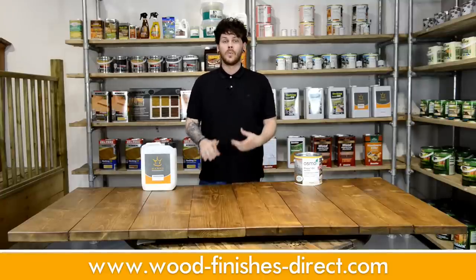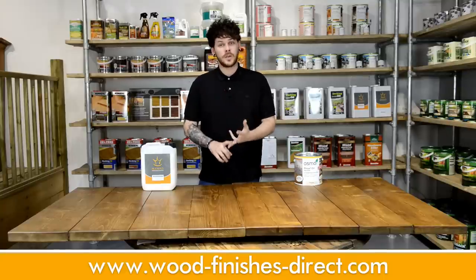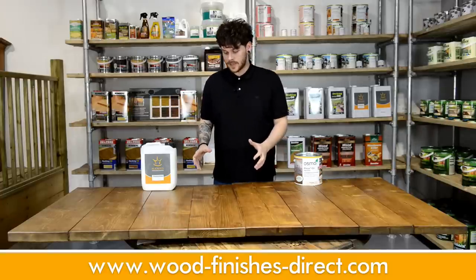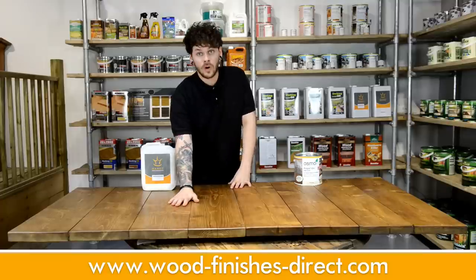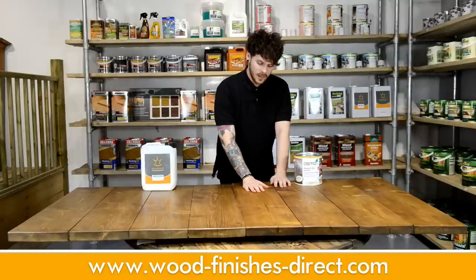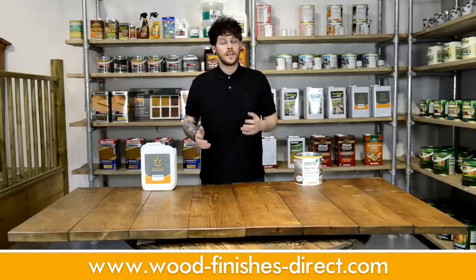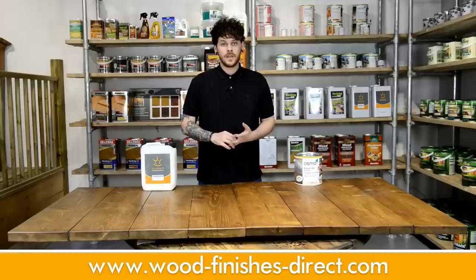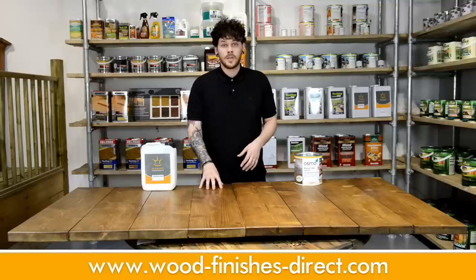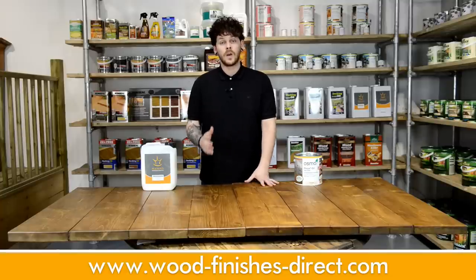What finish is right for you really does depend on what look you want to achieve, how durable you require the finish to be, and also how much time you want to dedicate to maintenance. I've finished both these boards and both of them look absolutely fantastic. The varnish feels strong and looks great. The oil feels and looks a lot more natural — you can actually feel the grain as you touch it. Ultimately, as with any wood finish, it's always best to do test areas. Decide what sheen level you like, get a sample of the oil and a sample of the varnish, try them out in different areas on your floor, see which one you like to apply, and see which one works best for your home.